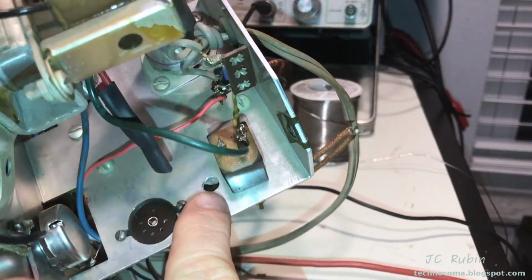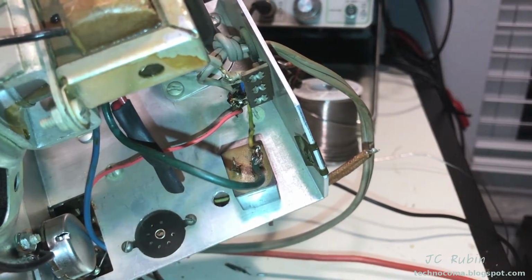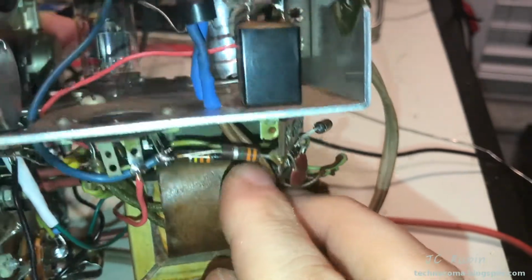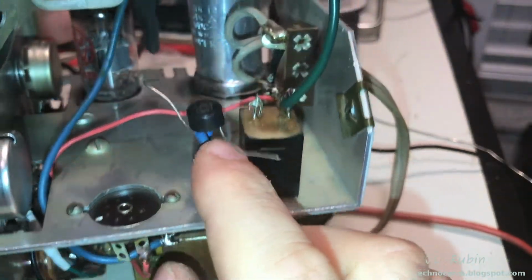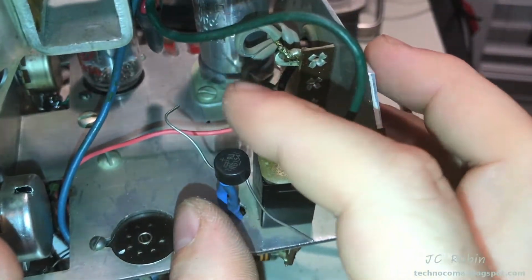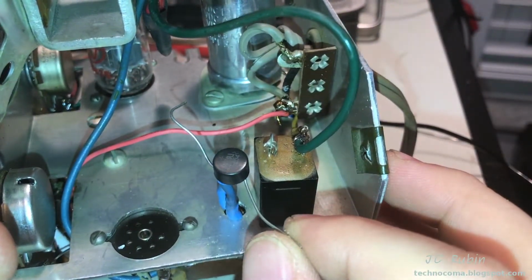First order of business is done. The hole is drilled bigger. We can now fit all the wires through. So I now have half the rectifier in. We can see that the 2 leads coming off the winding here are going right up into here. I've soldered everything together and dressed it. I now have the positive and negative side that I need to wire in now.